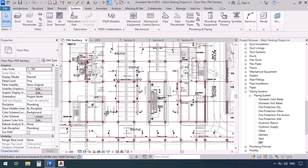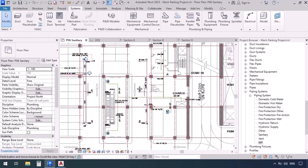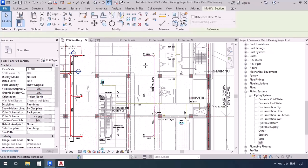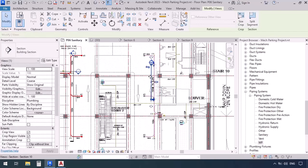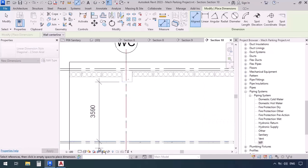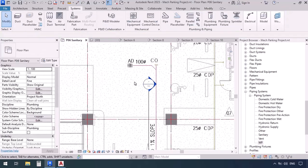Now as the last pipe we draw in the parking space, we're going to this part where we drew many ducts. We want to draw the drain system of this part so that later we can use it as an example for interruptions — checking that these pipes would not interrupt the already drawn ducts. Let's create a section; in my opinion the farthest drain from the riser is this one, so we need its elevation. Create a section here — click and click. Minimize it, right-click and go to view. Use the line dimension and measure from below the beam to the FFL, which gives us 359.